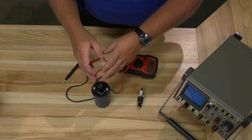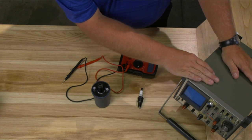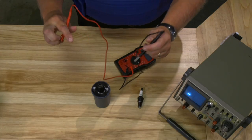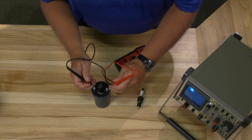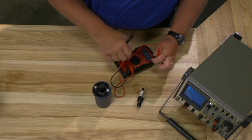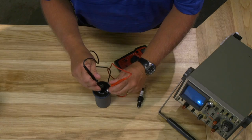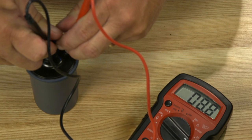That is when a weak coil can show itself. To check a coil properly, you need a tool called an oscilloscope. I realize that most farmers don't have that, so we can check it with an ohmmeter. What you would do is take your ohmmeter and go across the positive and negative terminals and take a reading. This coil has about 2.4 ohms. Then you would go from the positive terminal to the center terminal — you need to bring your meter up to a higher scale — and this coil has about 8,800 ohms from primary to secondary.